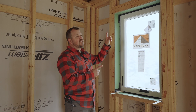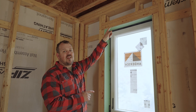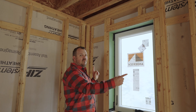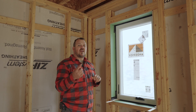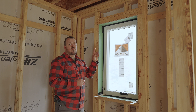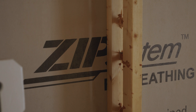It should be noted that this is a gable end — technically not a load-bearing header situation — but this is still a load-bearing header. You can order header assemblies from T-stud; you'll need to check with them on span. Everything on this house worked with their headers, and you can get them pre-filled with foam or naked, meaning no foam.